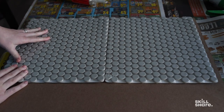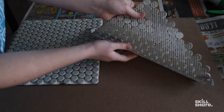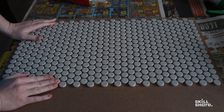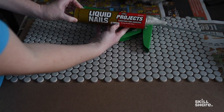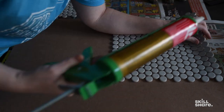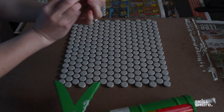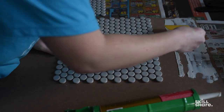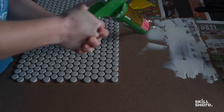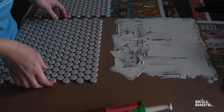To start out, you're going to want to get an idea of how your tiles fit together. The tiles come on a mesh, which is awesome because it helps keep all the little pieces together. Once I know about how they'll fit together, I can prepare my liquid nails by putting it in the caulk gun. Then I lay down a nice big thick stripe of glue and use the putty knife to scrape it into a nice even smooth layer.